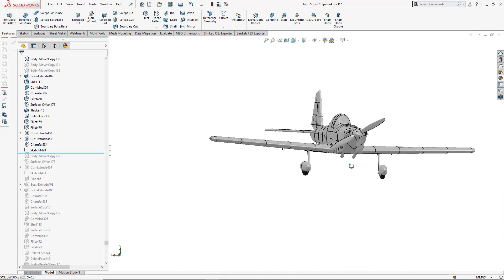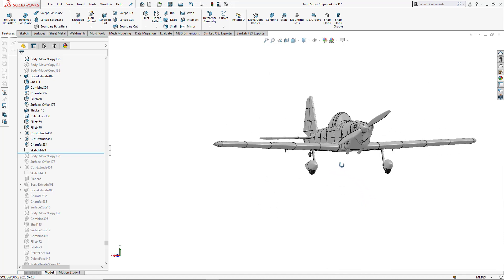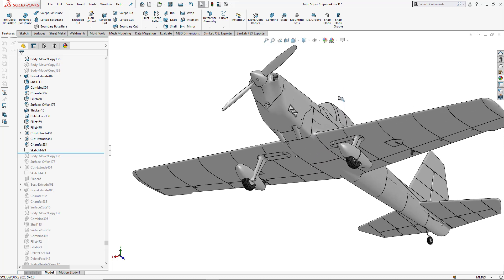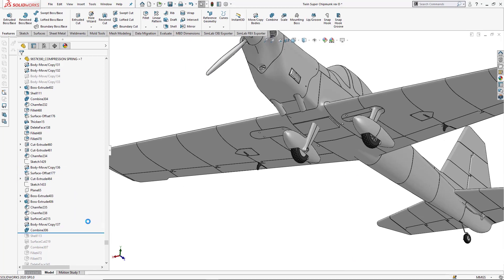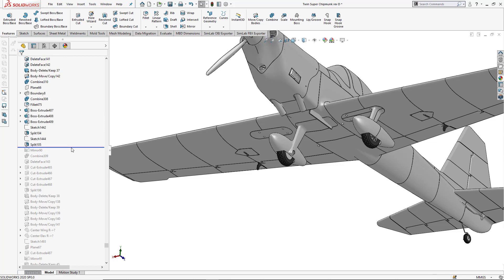I kicked off the design of the twin super chipmunk using the SolidWorks files from my original 1/6th-scale super chipmunk design completed last year. But building this twin version wasn't as simple as just printing out two of each part and gluing them together — there were several new design elements and engineering problems I needed to figure out. First, the landing gear needed to be repositioned. Its original position would be way too wide and put too much stress on the outer wing panels, especially with a less-than-perfect landing. So I shifted the landing gear to sit in the center of each fuselage. Rather than removing the recess in the wing, I designed a bolt-in plug to cover it up, so I can still use the same wing set for a standard super chipmunk in the future.